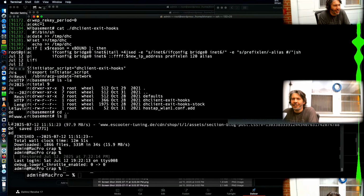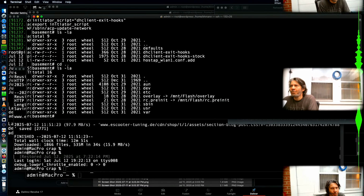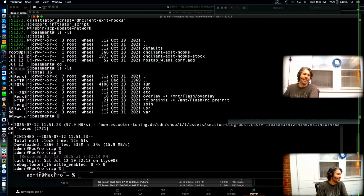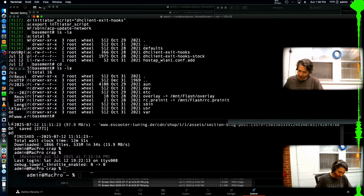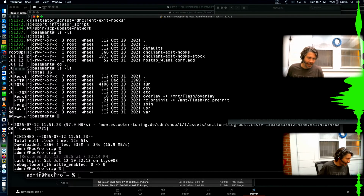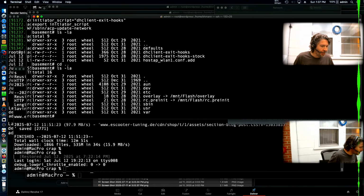So one thing that makes these AirPort Expresses kind of interesting is they do work together. If they're all in the same network backbone, Apple provides a few different services advertised using Bonjour. Nope, this is just too new. Yeah, one of them is the equivalent of 802.11, I want to say it's R or K, where the wireless network is able to provide information on the channels that are in use, so your client device knows where to roam.